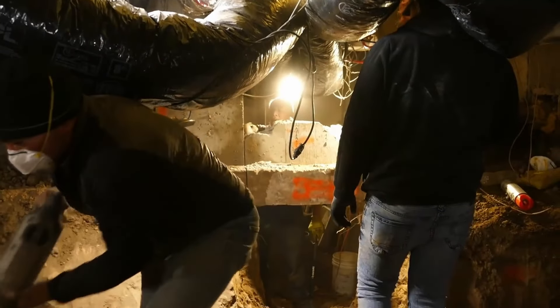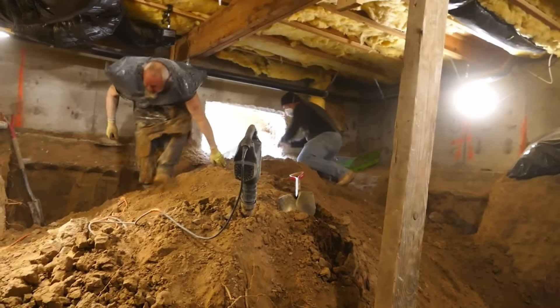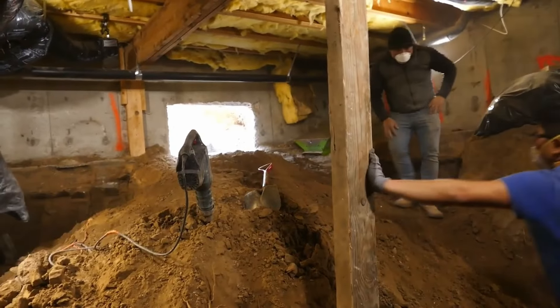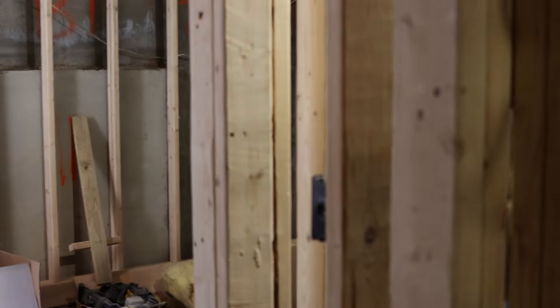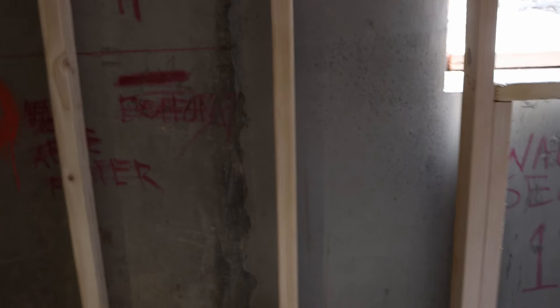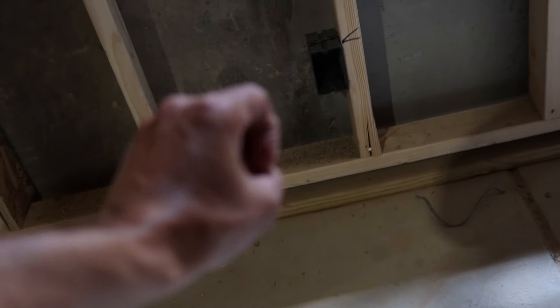Variables such as a giant boulder or an old foundation unearthed from beneath the soil are common and can cause delays. Gold's Concrete is typically on a basement dig out for three to four months — about two to six guys on the project at any given time during a normal work day. Where you see JC working on the floor, we dug this whole area down from a crawl space and poured new footers, new underpinning down beneath the old foundation. This is the old foundation; this is the new foundation — what went in beneath. So we dug all this area down to pour the new footers and the new foundation wall.